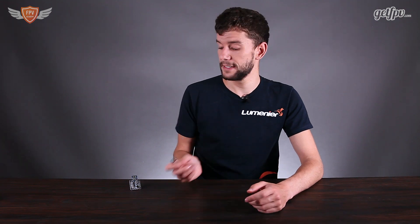This board does come with a capacitor included, and I would recommend mounting it as close to the battery source as you can. I personally mount mine on the battery cables themselves. What this does is help allow for a more accurate display on the screen — it makes the current reading a little bit smoother and not as spiky, which is a big help when working with very delicate measuring instruments on the power distribution board.